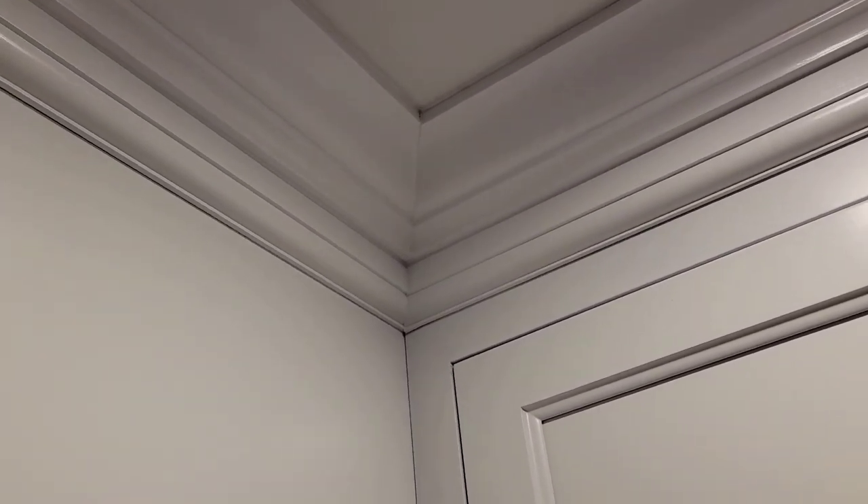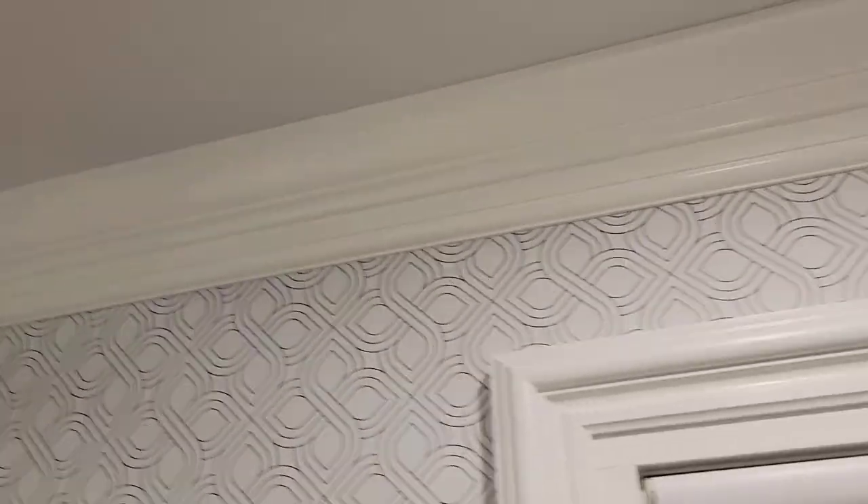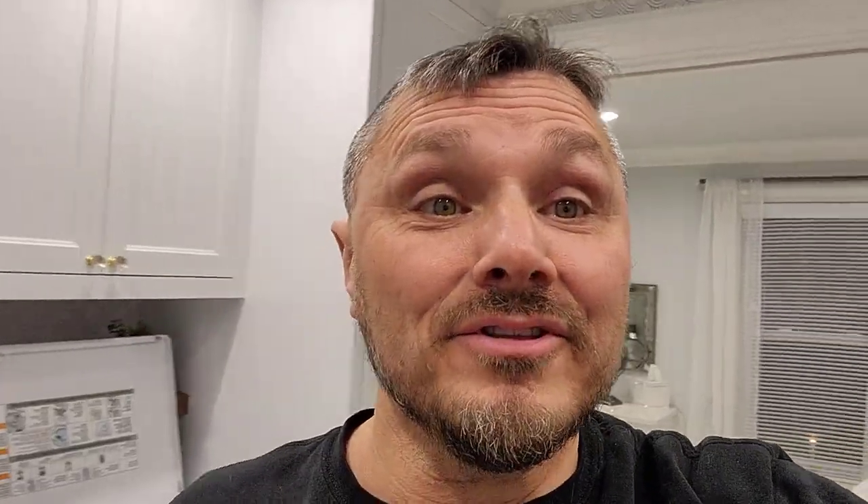Glancing in at these joints, you can see that they really are very, very tight. They look really good. As much as I would love to say it's because I'm a master crowner - I am not a master crowner, but I'm okay. And my wife is, however, a master painter. So I think she probably is the one really making everything look good. All credit to her - I just put the nails in. I'm really happy with this crown job. That crown jig made a world of difference - able to hold it correctly in place, cope and look at it, and know that you've removed all the material so when you install it there's no back material getting in the way. Double copes and three pieces - it's the way the room works out because I want the copes in the right spot. They hold in because of tension since you can't glue them. You spring them in there and it worked out great. These joints should not open up. All the outside miters are glued, all the inside double copes are tension fit. It should be good to go for a long period of time.